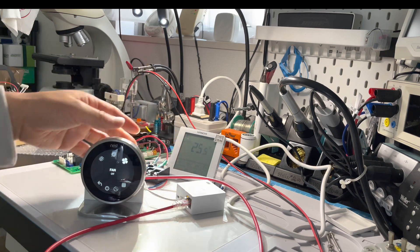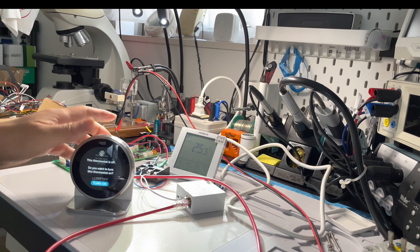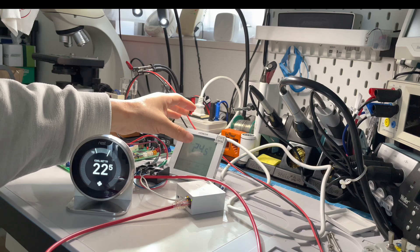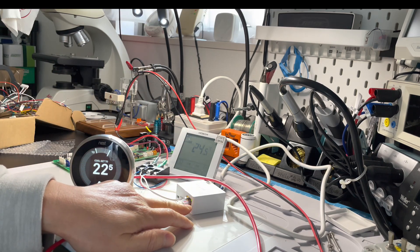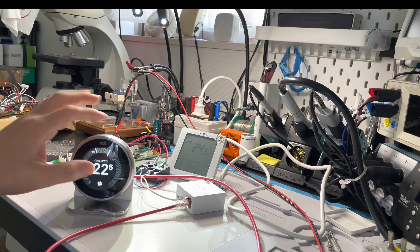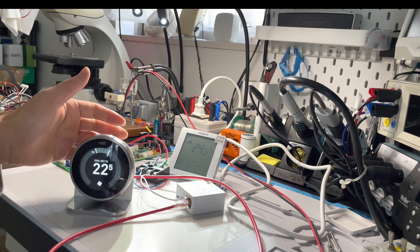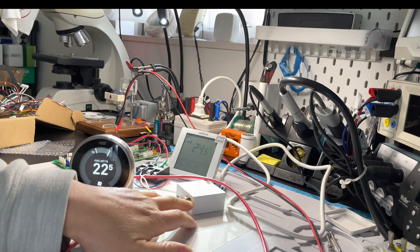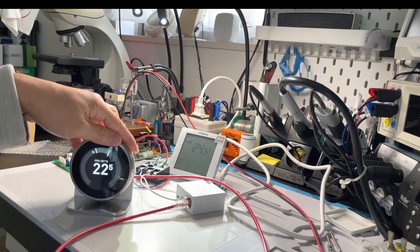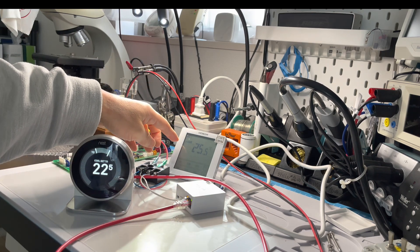You can see the original remote controller starts up. After the original controller finishes starting up, turn on the Nest thermostat and set it to fan mode. You will see the original thermostat begin fan mode, and the green light changes from blinking to always on — this means it is receiving a signal from the Nest adapter. You can check whether the Nest base wiring is connected properly by observing this green light. When you turn it off, the green light becomes pink and blinking, and the original controller turns off.